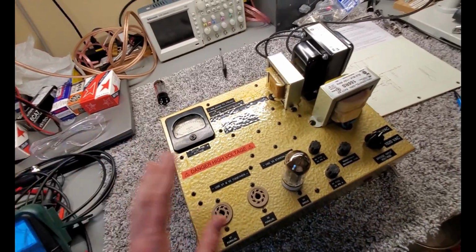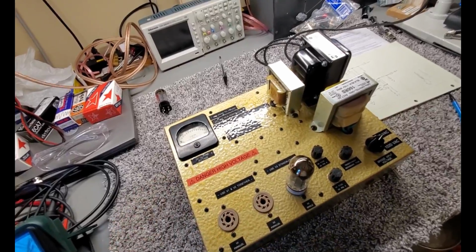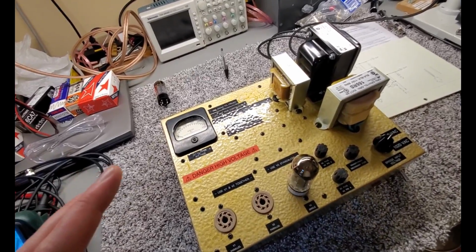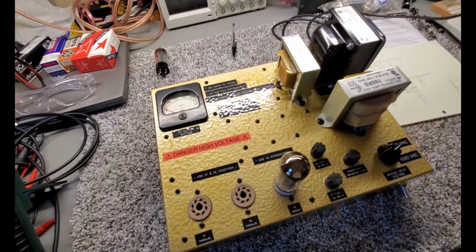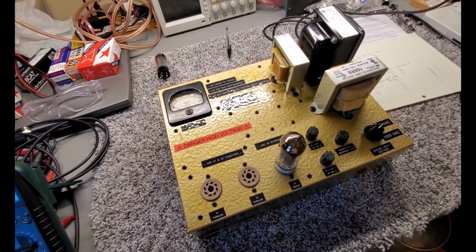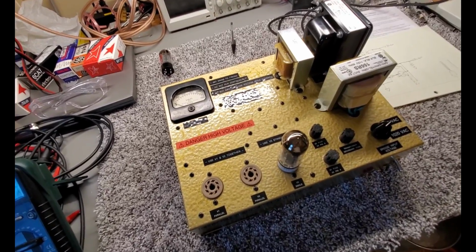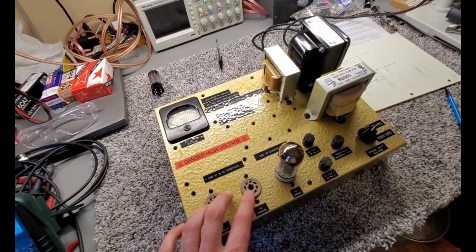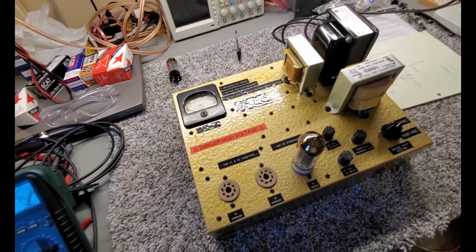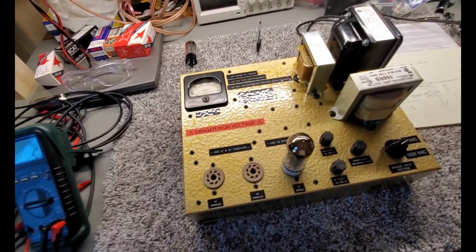And so, luckily, or maybe not luckily, in finding all these arcing rectifier tubes, we happened to test those protection mechanisms in 2845, and everything works and is happy. We didn't damage anything in the amplifier, which is great. But we still want to avoid this if possible, and we want to make sure we don't put rectifier tubes that could arc or have a potential to arc, especially stuff that we send to our customers. That's just not good practice.